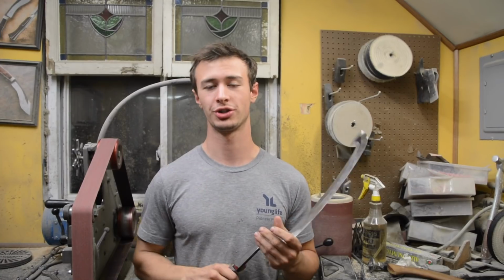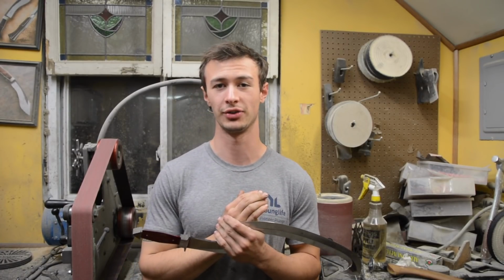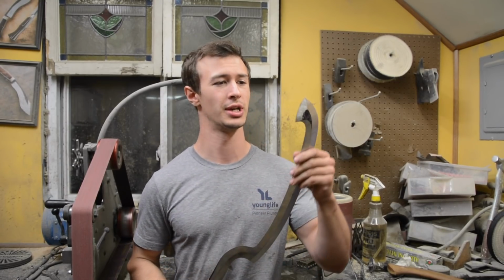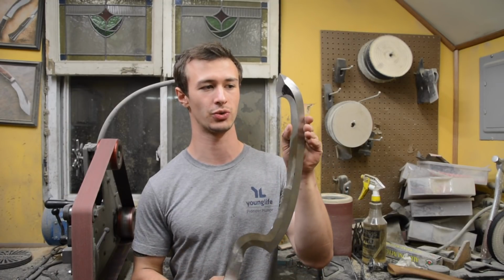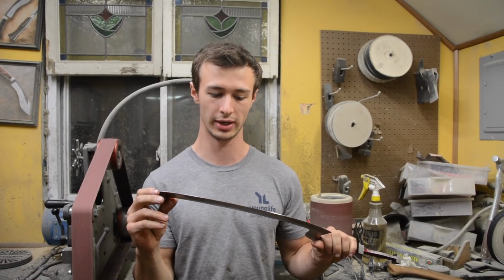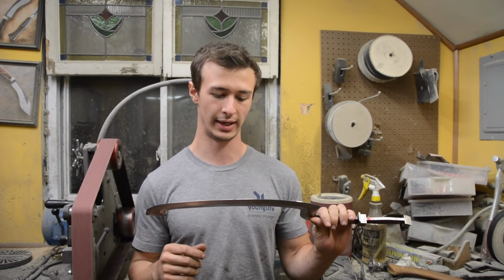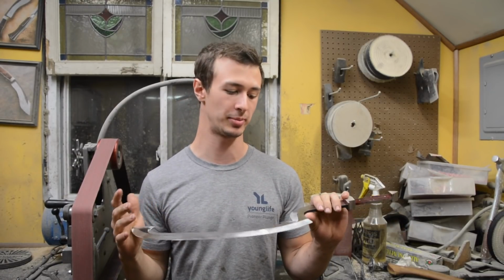And you all just saw me do the final grinding, or part of the final grinding on the sword. It was probably just a couple minutes of footage for you all, but that was actually 2 hours on the grinder. And I have the whole sword now up to 120 grit. At 120, I'm pretty much getting my edge thickness where it's going to stay with the final product, and bringing all my lines really close to their final spot.